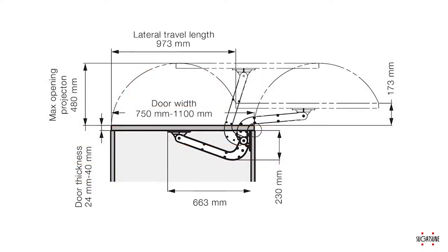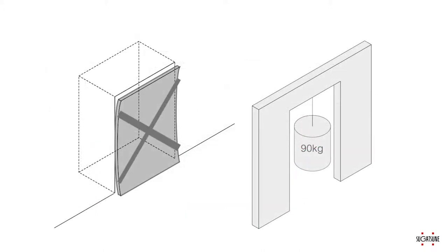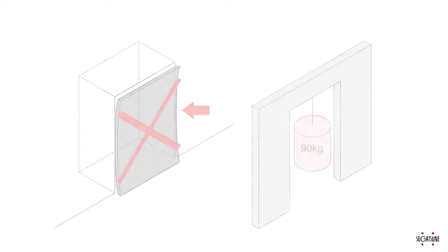The cabinet depth should be 9 and 1/4 inches minimum. If you have wall moldings, you will have to ensure that the door has enough clearance to open and not hit them. Before you begin, please ensure that your door panel is not warped and that the framing around your door is strong enough to support it.